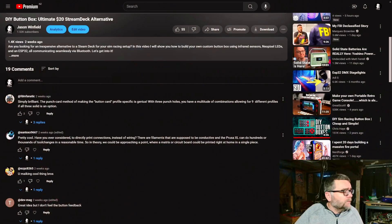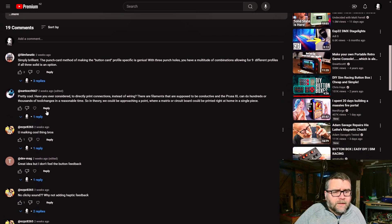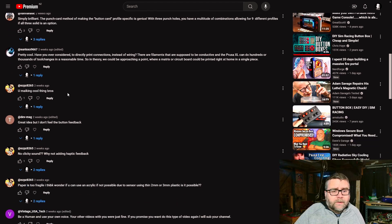There are a couple of comments on that video I just wanted to address. The punch card system — I think it'll be useful. You can use nine different cards for nine different games. Pretty cool, you can set it directly. As for printing connections instead of wiring — the problem with copper filament is it's got high resistance and it's not quite there yet in my experience. Version 2 is monocolor since I can only print one color, so until they get something sorted with that copper filament it's not really a practical solution at the moment.